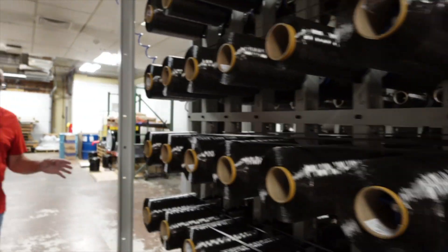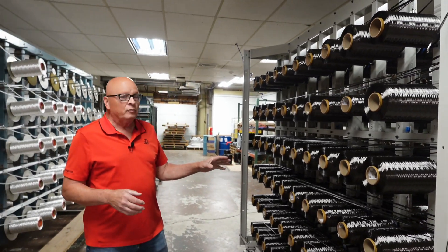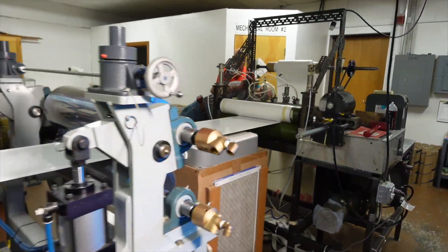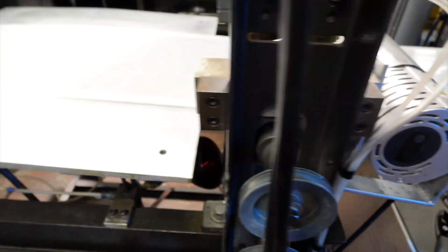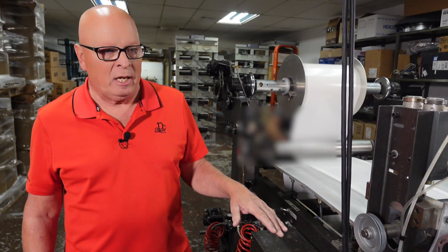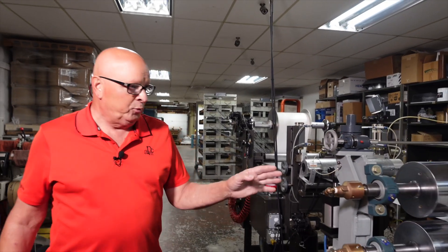The process starts here. The creels are designed for carbon fiber and unidirectional materials, tensioned by air pressure to the exact amount needed for each roll. The material comes through the creel and the purpose of bringing them together is to collimate them to the weight requirements needed by the customer — spread far apart for lighter weight or closer together for heavier weight material. It comes through the machine into the coating head, where the material is put between the epoxy resins, which are heated and melted 100 percent into the fiber, then cooled and pressurized through the nip rolls through the cooling section.